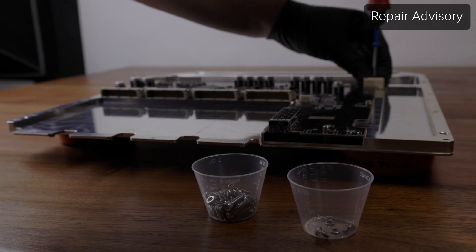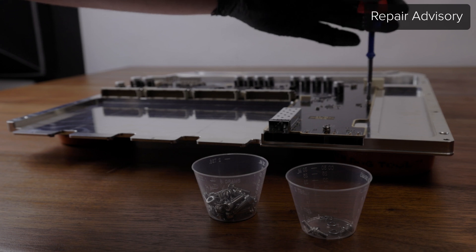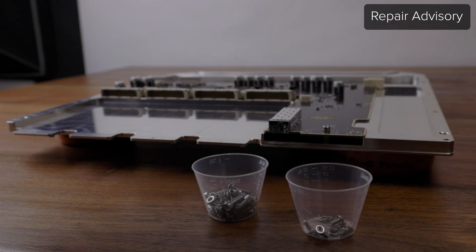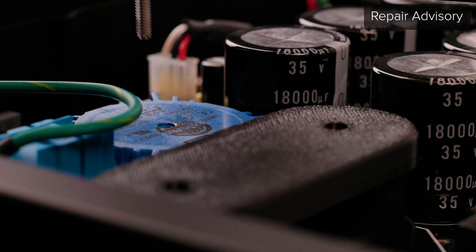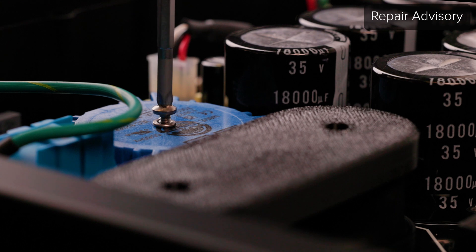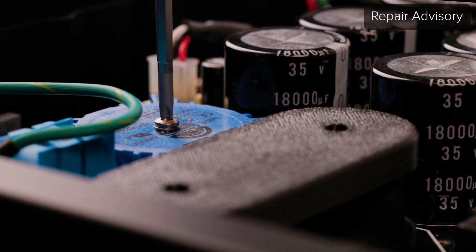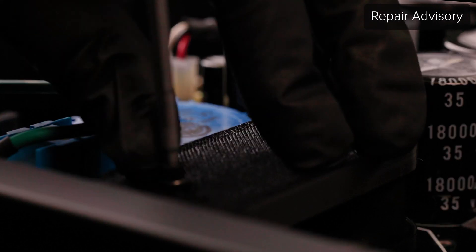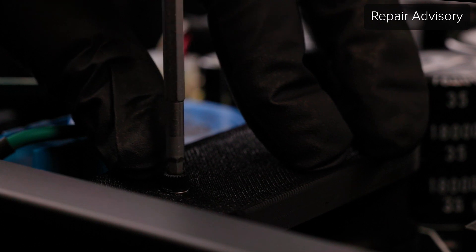It is important to keep track of all hardware throughout the build process to prevent any loose hardware from getting left inside the unit. Also, keep in mind that there is a variety of hardware used in each product. Some products use soft nylon screws to prevent unwanted electrical connections. These screws are delicate and can cross-thread very easily. Other products have crucial heat-sensitive devices. If over-tightened, they can crack and shorten the life of the product. Pay careful attention to what type of hardware is being used, and how it is being used, when disassembling your product.